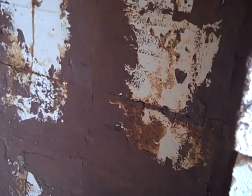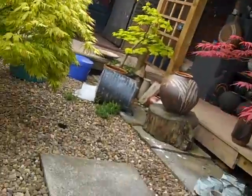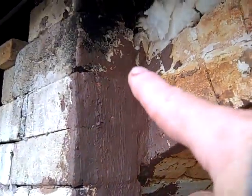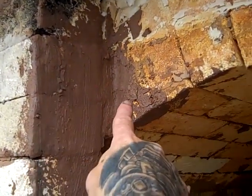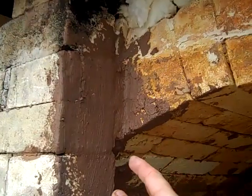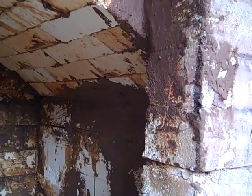So I've mixed some fibre which I took from the roof around the corner with some clay that I keep especially for this. It's just some old rubbishy clay that I've reclaimed, all slops and bits off the studio floor, and rather than waste it, I've sealed all the way around both doors, the top of both doors, where this brickwork doesn't key into the arch. You put the arch in separate and it's not keyed in, so it moves a little bit. So I've sealed all the inside and in the back of there, and it's solid now, it's not going anywhere.